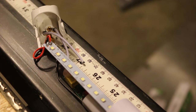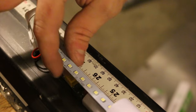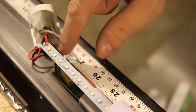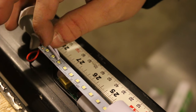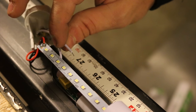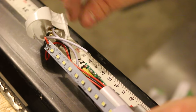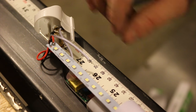I guess I should consider myself pretty lucky — out of the 25 LED lights that I bought, only one was not working. I've disassembled it, taken the end cap off, and pulled out the light assembly. Here is the power supply, and as you can see, they just missed a solder — it's not even tinned or anything. It just needs to go right here on this black lead. I'm going to attempt to do that right now.